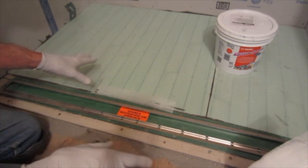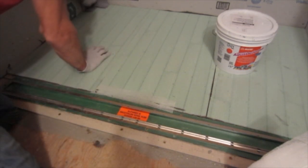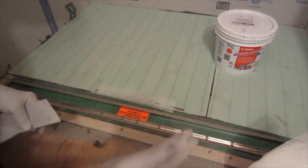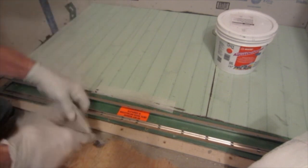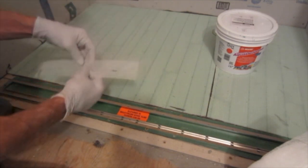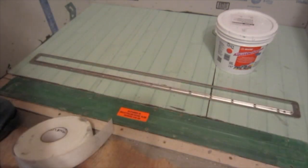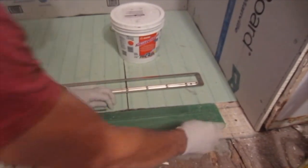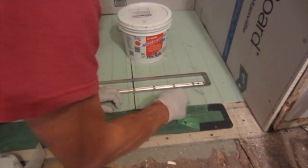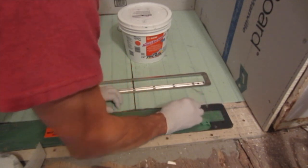Quick Drain USA sells a kit for liquid waterproofing which includes inside corners — these are for their membrane kit. They sent me the wrong kit by mistake, but I can still use these for my inside corners. I have some fiber drywall tape; their fiber tape is just a little bit wider. You're going to remove the clamping collar, then remove the outside piece of the green, and you can make a real mess with your waterproofing because you're not going to open up the inside of the drain until later.